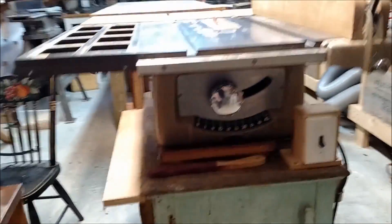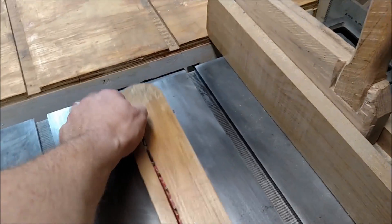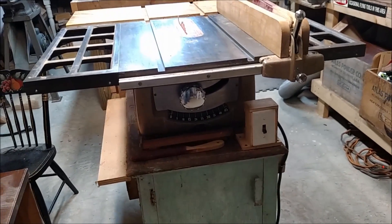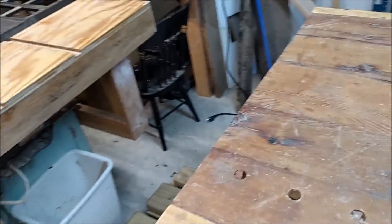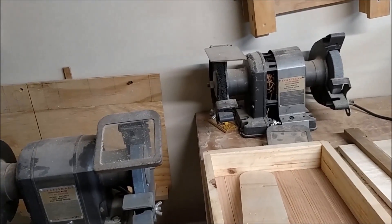The table saw here — I did a video on that a while ago. It's a 1950s Craftsman and it's a really well-built table saw. I got extension wings on eBay, which cost a bit but give it a lot of extra room on the sides. I made a zero-clearance insert out of maple, which is really nice. It's only a nine-inch saw with an eight-and-a-quarter inch blade, but I really like it — I think I paid $100 for it. I built a box for the switch, and the original cabinet on the bottom has a plastic bin to collect dust. I also built a small outfeed table that I can bring and back up to the table to catch pieces so they don't fall and to protect the motor.